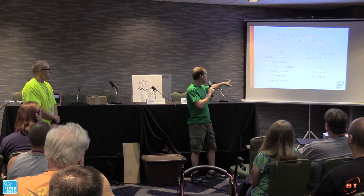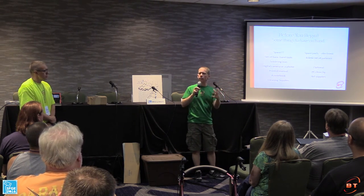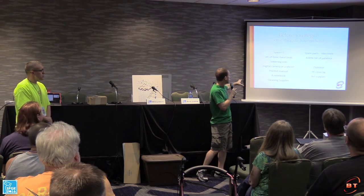We're not going to get into board level type stuff, but I'll talk about that in a minute, and why it's important to have a good basic iron. A digital camera or a smartphone, and we'll get into why. A printed manual is a big deal. I've done a few machines with just manuals from the web. It's doable, but a lot of times you lose the specifics like part numbers, and we'll talk about that. So if you don't get a manual with the machine, it's very helpful to hunt one down.